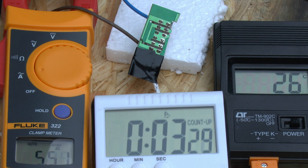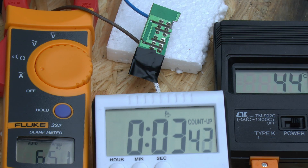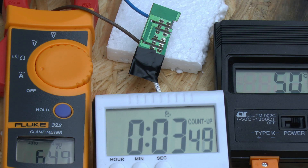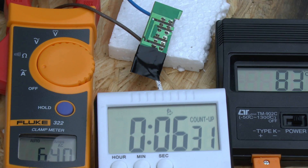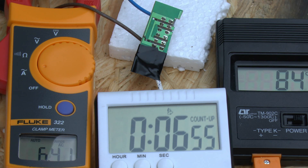Let's go up to about 6 amps, which would be the theoretical maximum for a fairly typical lighting circuit. The current there is just about 6.5 amps - just over that. You can see the temperature is now increasing fairly rapidly, around the 44-45 range. At about 6.5 minutes in, the temperature has increased to a rather unacceptably hot 82 degrees, and current is about 6.4 amps. This is certainly within the realms of an actual lighting circuit. 83 degrees or so is pretty unacceptable because that's the sort of temperature where plastics are going to start melting or being damaged - but in any event it hasn't set on fire or done anything else. Let's turn the current up even further.